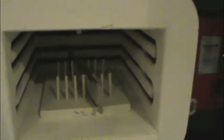Here we are in the oven. I've got the knife packet loaded up with the seam side down. Nobody's ever told me to do this — it just kind of seemed the obvious thing to do, just in case it tried to unroll or something once it starts inflating from all the heat pressure. I've got my kiln ready to go, so I'm going to shut it up and hit start.